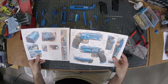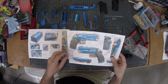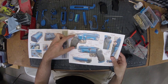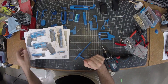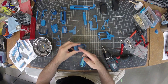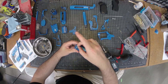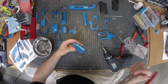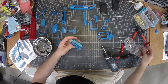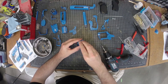I have this diagram that shows which kinds of screws go where. For the most part the lengths you can tinker with a little bit, but sometimes it matters whether two screws are going to meet in the middle — you want to make sure they aren't too long. You'll figure out which holes need to be drilled bigger and which ones need to be threaded. For example, that one gets an M3 socket 10mm long and the back is an M3 cap screw 8mm long.